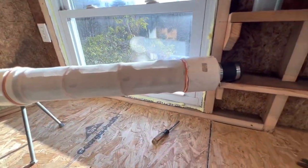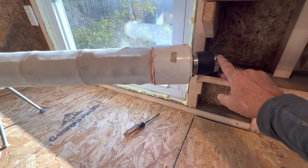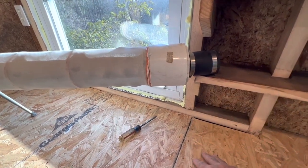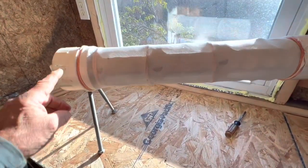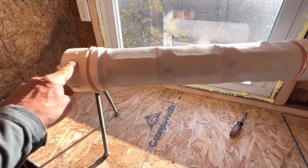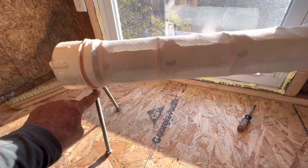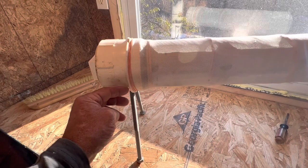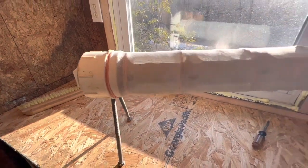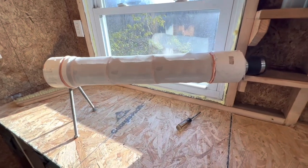This is about how it's going to sit. The pipe in that spring box — I'll show you — I have to clamp this thing to it. It is 11 inches from the bottom of the cement floor up to the pipe, which is about where this thing's sitting right here. Because of the weight of this thing, I didn't want it hanging down into the mud or into the sediment, so I put two half-inch galvanized bolts right here. I drilled through and just bolted them through the end of the four-inch coupling.